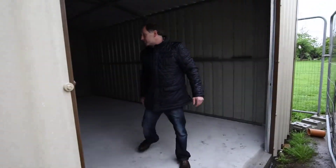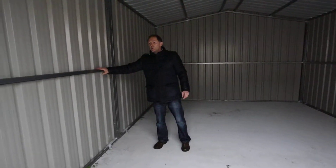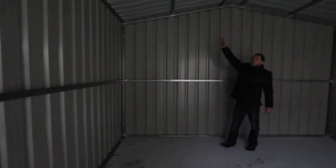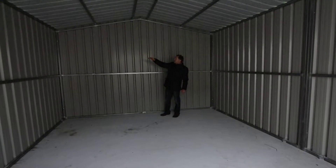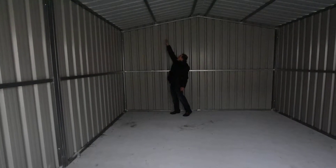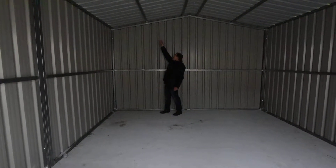If you just come on in here — as usual, it's all galvanised box iron, welded and bolted together with cup head bolts. You can see there the welds. Up here it's non-grid sheeting on the roof, and there's no clear light. This shed is going to be plied out and insulated by the customer themselves. The brackets up here are welded to the box iron, and then the bolt comes straight down through the galvanised purlin on the box iron and bolted through.